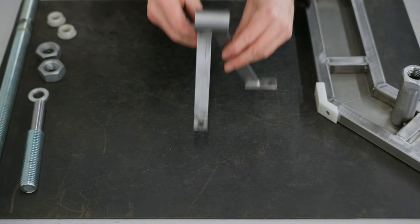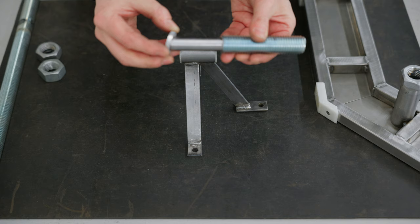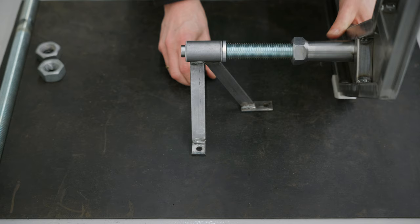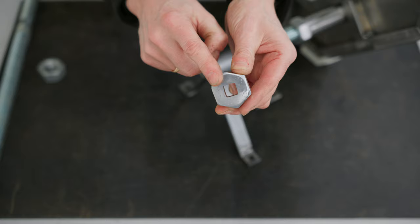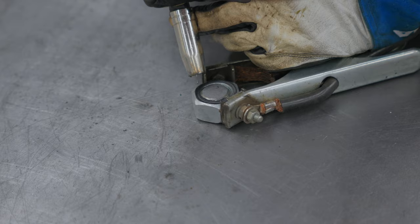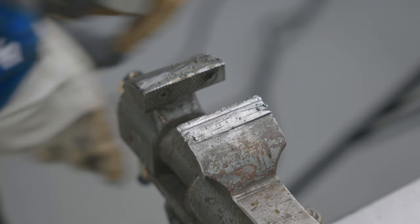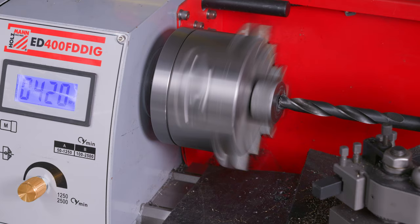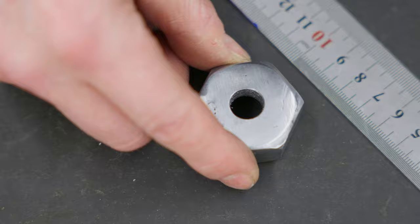The feet are done and I must say this design is impeccable. Let me do a quick assembly — the shoulder bushings go in like this. I made a washer that fits to the axle, and then the axle is threaded into the clamp. The remaining part is to make some way to crank this around. My idea is to use this nut that I've prepared with a square hole. I started with a regular nut and a slice of threaded steel rod and welded it all together. A bit of grinding — I tried to use my lathe for getting a hole in the center but that really didn't turn out. The bench drill saved me this time, drilling out a 12 millimeter hole, and then preparing the nut for some filing. You don't always need very sophisticated tools — a vice, a file, and some patience and you're there.